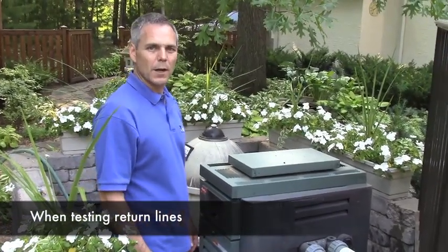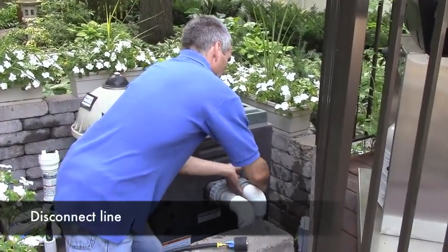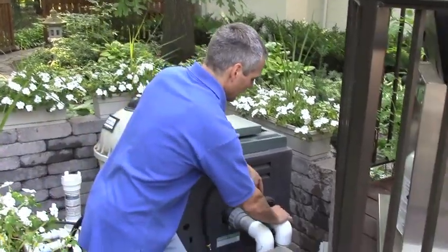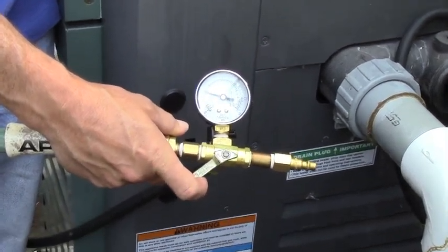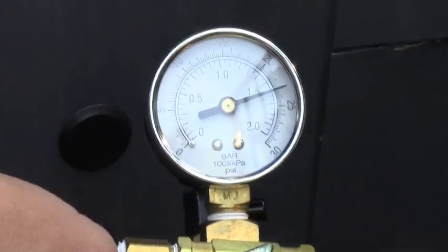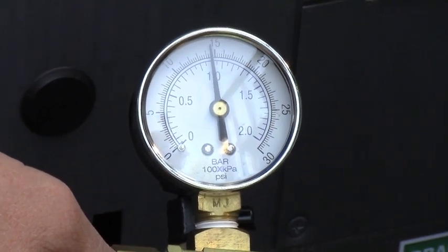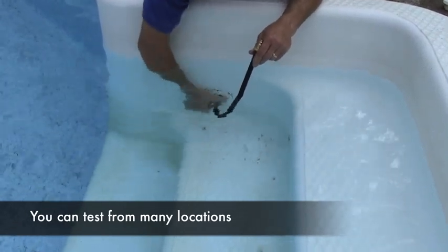When we're testing the return lines at this pool, our best access point is after the heater. We're going to disconnect the coupler so that we can get right into the return line that goes back to the pool. I'm going to use an open stem plug with a hose going to the quick connect this time, and we'll go right into this pipe. Now we're testing our return lines — I'm going to bring some water pressure into the plug system and close the valve. We're not holding pressure. Looks like we've got a leak in this line. The versatility of our pressure testing system allows us to induce pressure as we did here at the equipment, or we can put open stem plugs into the return fittings of the pool and induce pressure from that side or from the skimmer.